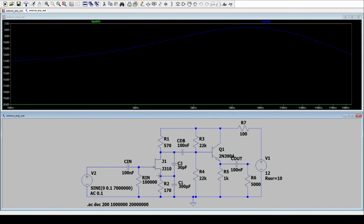It's not so easy to really understand how much is where and how does this all affect the circuit. But understanding that these stray capacities have something to do with the package of the component. It has something to do with the circuit board, the distance of the traces, what kind of traces do you have, and so on. But you can see here in the simulation with these figures that it is rather realistic that these different stray capacities can affect your amplification significantly. And well, that's what we've seen and that's what we have, and we have to more or less live with it and optimize the circuit board in a way that you get rid of all those as well as possible.